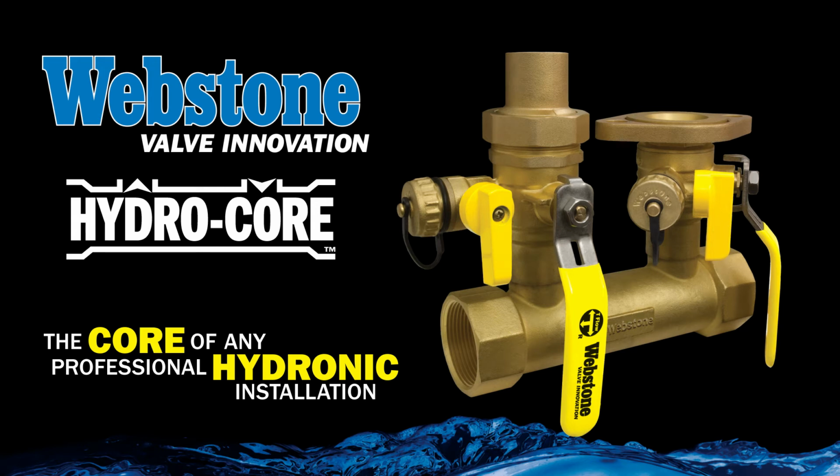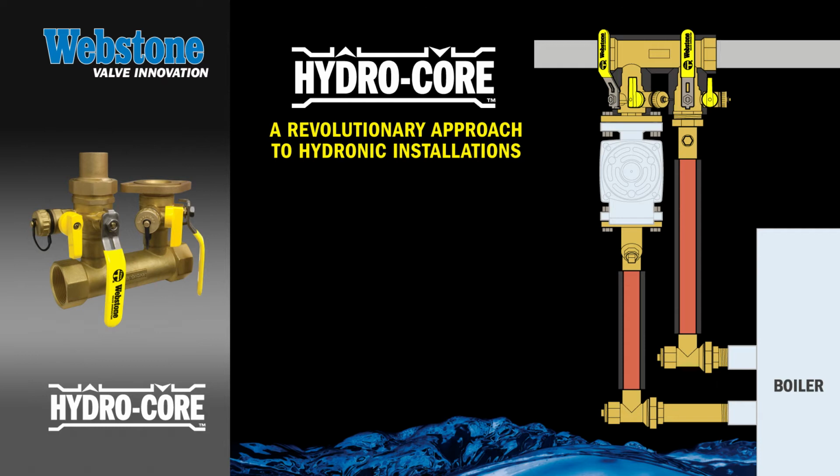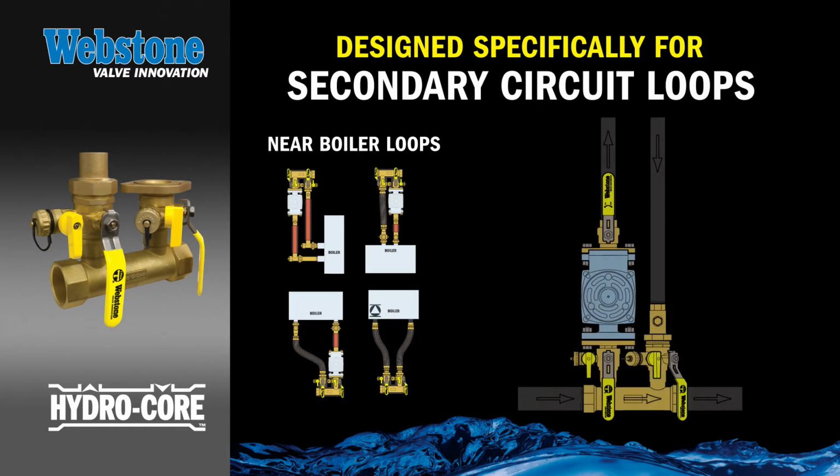Once a hydronic heating system design is completed, the initial focus is to configure the near boiler piping to a high-efficiency boiler. The objective is to create an effective and efficient method to deliver BTUs from the heat source to the hydronic delivery system. Webstone has developed a revolutionary approach for simplifying the installation of near boiler loops by combining a sophisticated forged brass manifold with prefabricated supply and return lines compatible with the most common boiler orientations, including floor standing side mount, floor standing top mount, wall hung, or wall hung boilers with an integral pump. The Hydrocore manifold itself is also suitable for installation in secondary circuit loops.